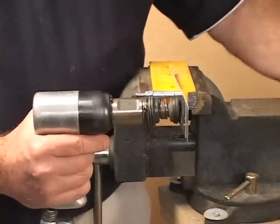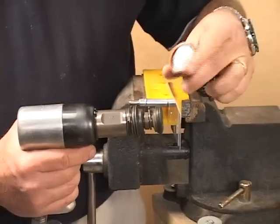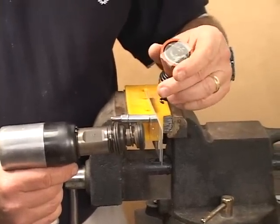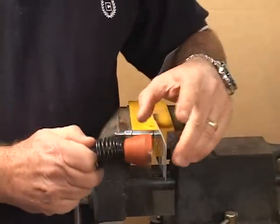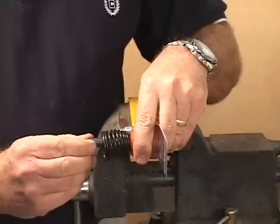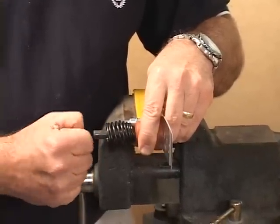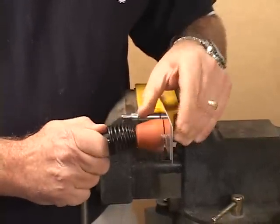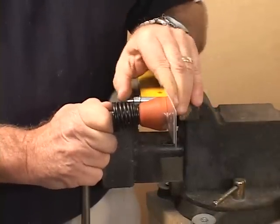There's another type of rivet head — again, a mushroom type rivet head with the rubber around it. The only thing different on this head is as you set the surface, you can see the shaft actually turns. So it helps you even more. If you happen to be a little bit off-center with your gun, your rivet head will stay flush with the material that you're working with.